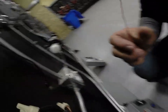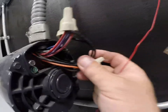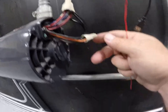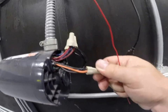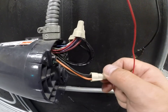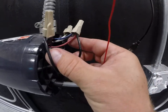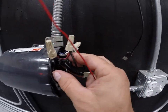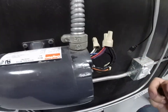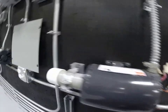Let's take a look at the enclosure. If we swing back around, you'll see how small this enclosure truly is — there's not a lot of room in there, and you can also see how small some of these wires that come from the motor are. Here's the splice that has T4, T5, and T6 all spliced together under one wire nut. And then one of these sets is your phase conductor, another set is your phase conductor, and another set is your phase conductor. We pulled blacks all the way down to these. Four wire nuts tapped correctly, and we would have to then tuck these into this tiny little hole and put a cover on it.